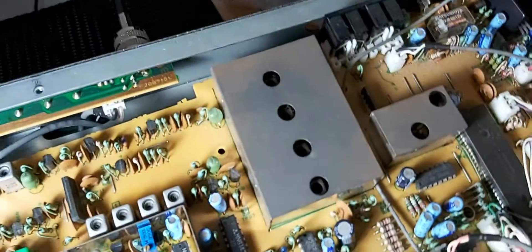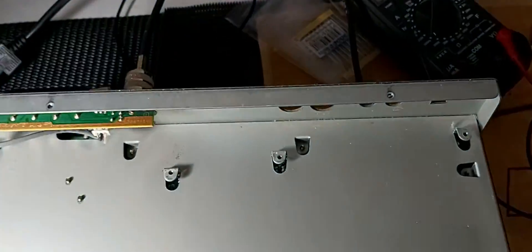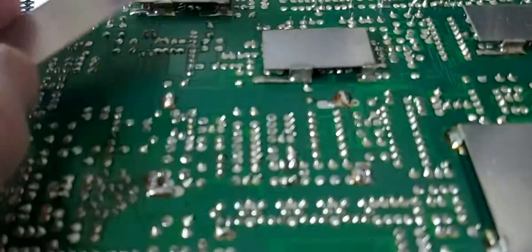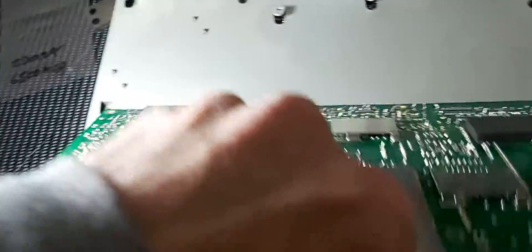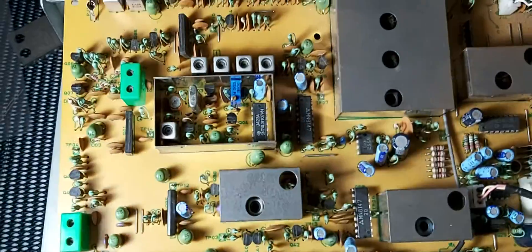To get to it, it's pretty simple — just take off this corner connector here. Then underneath the top board there is a shield plate you'll have to remove by desoldering. That's this one here, which sits there. You desolder that to get to the circuit board components, and then just replace R18 with the 50k trim pot.